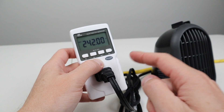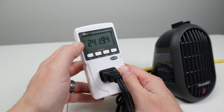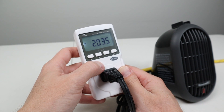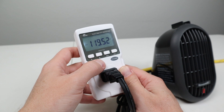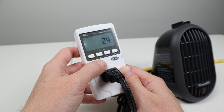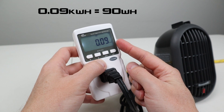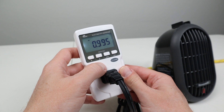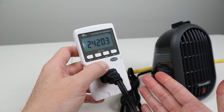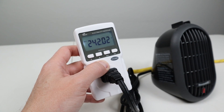I have a 250-watt heater plugged in connected to my wall-vin extension cable, and we're seeing 241 watts going out from the device — 2 amps of current, 119 volts at 60 hertz. It's been running for 24 minutes, and during that time we've pulled 90 watt hours. You can also see the power factor and then back to wattage — very useful for estimating run time.